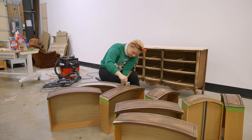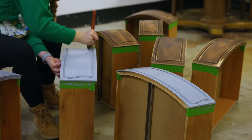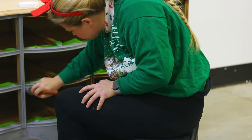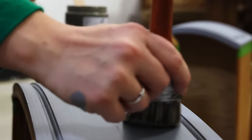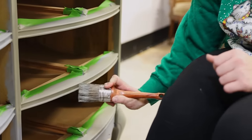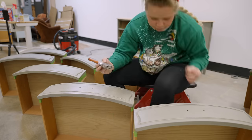Then I took Lily Moon's Eclipse Primer, which blocks stains and tannins from popping through. And then I covered the entire dresser with Magnolia Garden. I used Lily Moon's Opulent line, which actually is an all-in-one paint including the primer, the paint, and the top coat in one formula. It's also really great at self-leveling to give you a perfect finish, even when you're brushing on.